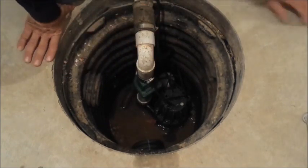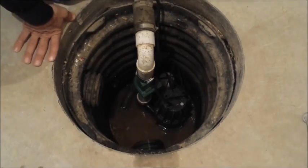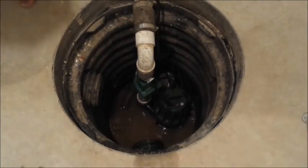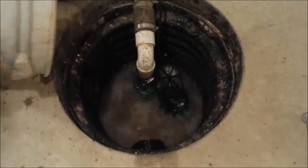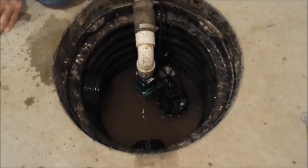It drains all the water out, and then the water drops back down. This is what I want you all to do — try to trip your sump pump and get it started manually. Make sure that it's running. We don't want to find out when it's raining, or some early morning you come down and find two inches of water in your basement. You want to find out now if it's working or not. Another way to check it is to pour water in there. I've got my son Jake here with a bucket of water — let's let him dump this in and see if the pump kicks on. Okay, that's the sound we wanted to hear. We poured the water in — took a couple of buckets — and the pump kicked on. Now you know you're safe and can feel more confident. Next time it rains, your sump pump is going to kick on and you're not going to be stuck with water in your basement. So get out there and check your sump pump.